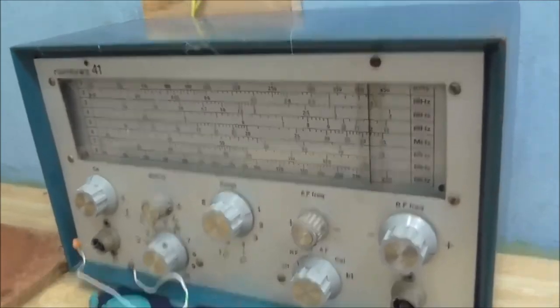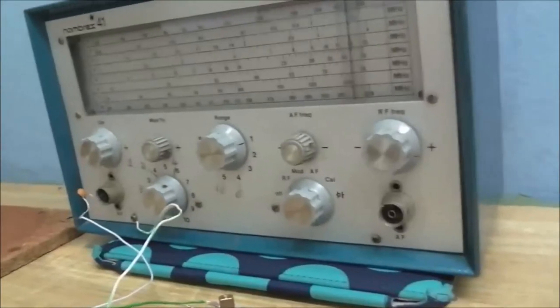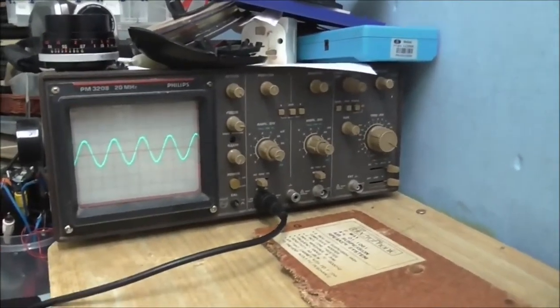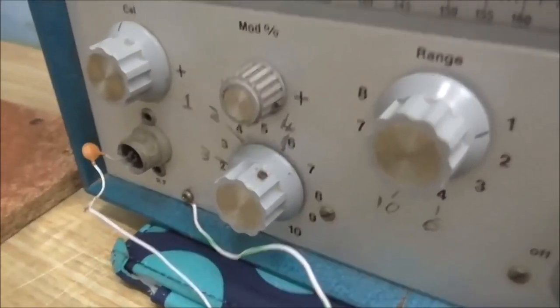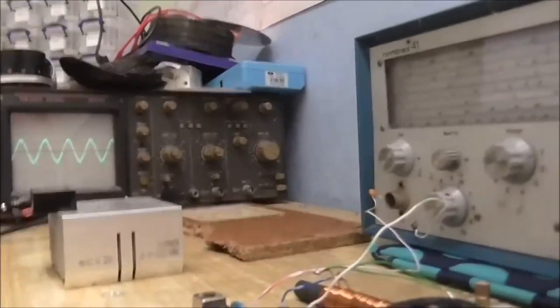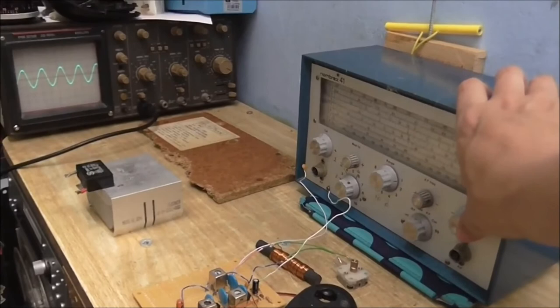And I've got the frequency generator set to pretty much round about the 400 kilohertz region. Actually, that's on about 420 something kilohertz at the moment. So I'm just going to sweep this up and down until we get the most response out of the oscilloscope. And I've got the output set to as low as it can go because this does have an AGC, so I'm going to try to defeat that. So, let's see what we get. Sorry about the mess in this place, but...